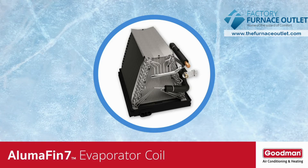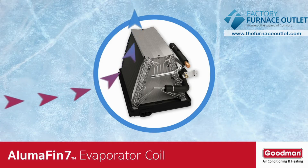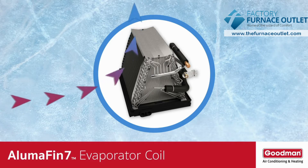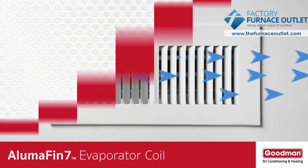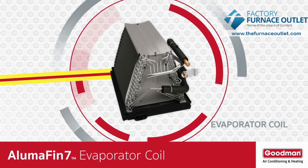When the warm humid air from inside your home passes over the cold evaporator coil, the water vapor in that air condenses on the coil. That's a technical way to say the cold evaporator coil removes humidity from the air inside your home. That conditioned air is then returned to your home through the ductwork. So now you know that the evaporator coil is the real star in a split system central air conditioning or heat pump system.